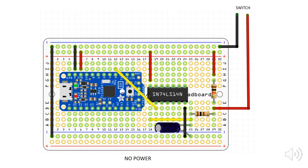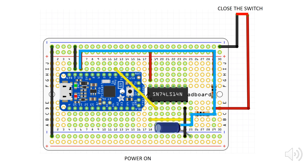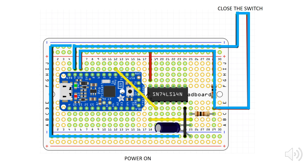This shows how we would wire this circuit to an Adafruit Pro Trinket using a capacitor, a Schmitt trigger, and two resistors. Notice that we're measuring the signal coming off the capacitor through the Schmitt trigger, as shown by the yellow wire going through the Schmitt trigger to pin 3 on the Pro Trinket. When the power is on and the switch is open, the capacitor charges and produces a high signal which is reversed as low when it passes through the Schmitt trigger to pin 3. When the power is on and the switch is closed, I provide a means for the capacitor to discharge through the circuit. The delay for the discharge will again be proportional to the RC time constant, giving me a means to set my debounce time through hardware rather than software.